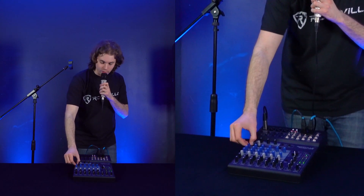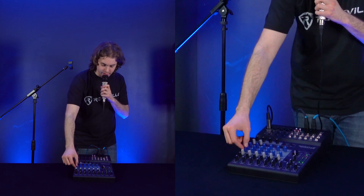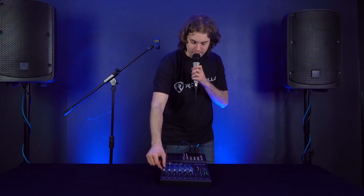With this type of setup you can use the features of your mixer like the built-in EQs and effects to get some really cool sounds. For example, I can use the EQ to change the overall sound of the microphone — raising the low end for more bass, bringing up the high end for more treble — and I can use the built-in effects unit to add effects like delay. Also, when using dynamic microphones in general, you want to keep them nice and close to your mouth so you're hearing all the characteristics of your voice. If you keep it further away, you won't hear as well. This setup is also the same if you're using an active mixer with passive speakers.